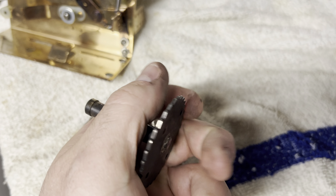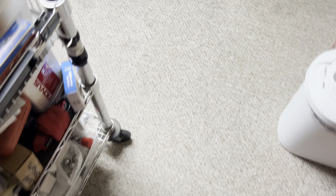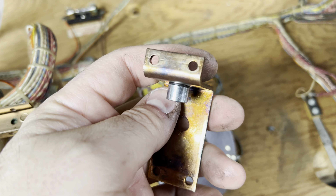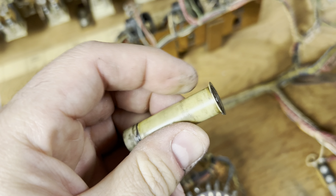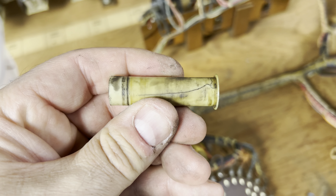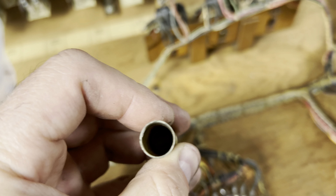The teeth should have a little oil on them, but it was just globbed and greasy. That's why this is all apart. I had to put a new coil stop on here because the other one is actually broke off inside this coil, and I think it split the coil. You can see this line right here — it actually cracked the coil.